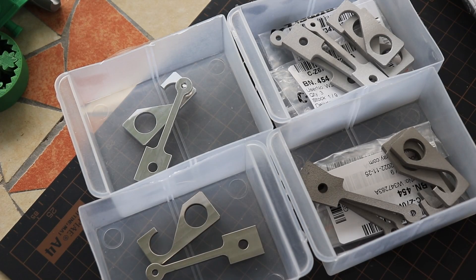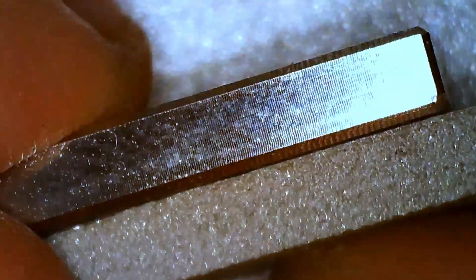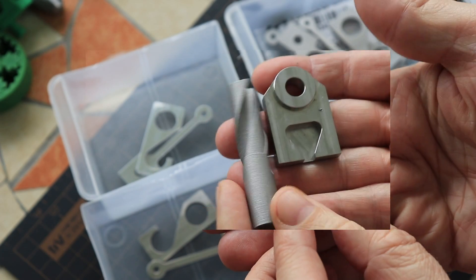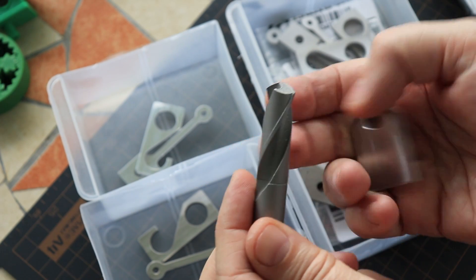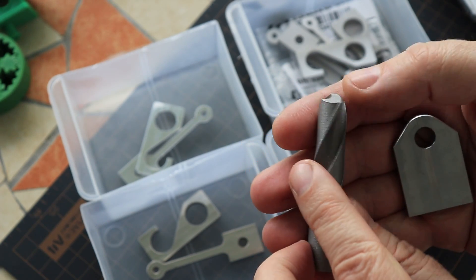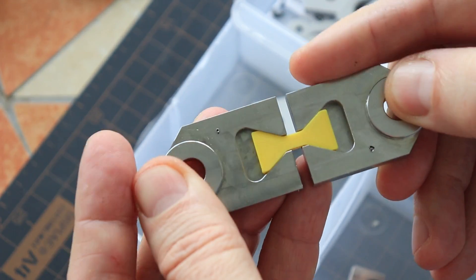Let's start with the comparison — first a few obvious things. As you can see, the quality of the CNC machined parts is always much better. This is CNC machined and this is 3D printed — as you can see this is very shiny, and here I can actually feel the inaccuracy in the surface quality. The accuracy of the CNC part is basically one hundredth of a millimeter. This cross-section holder has the same cross section but without the hole or any weakness in the cross section.